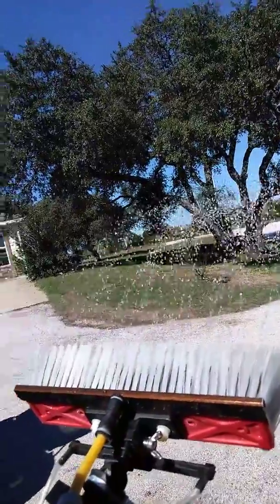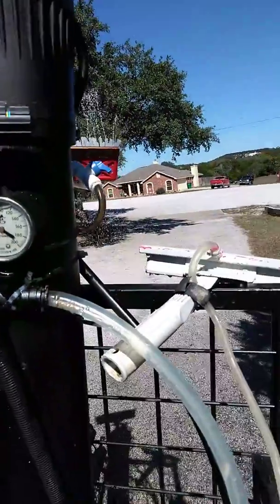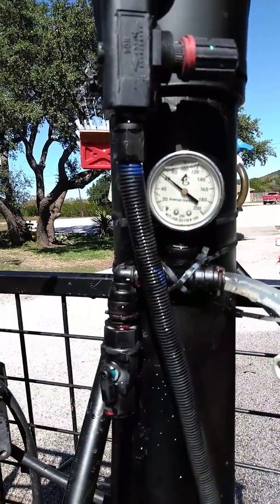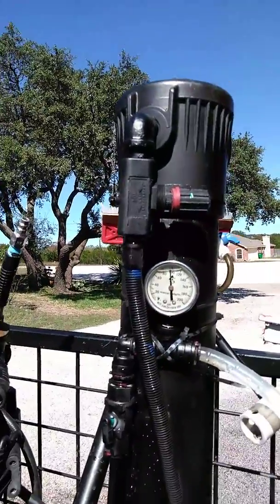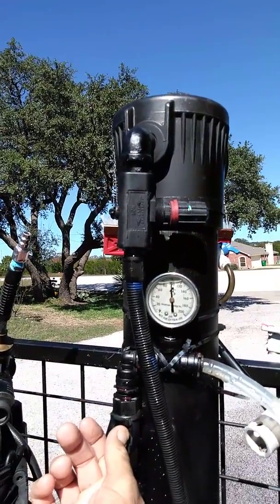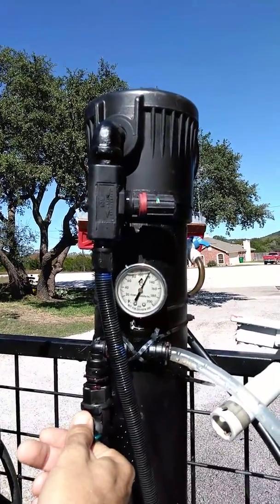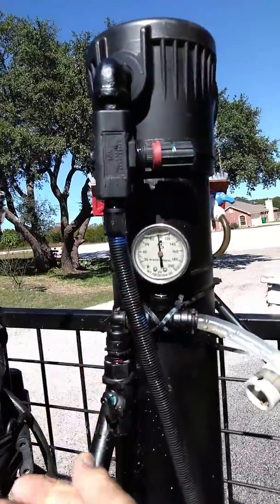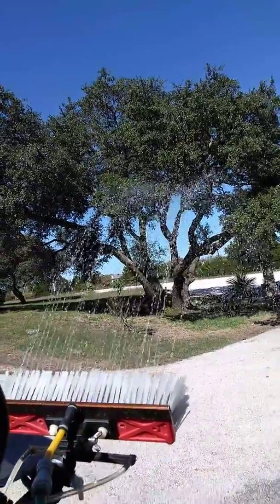One of the reasons I don't like ROs is unless it's boosted you get pretty crappy flow. That's not flow — I like my flow. So what I do is I've got to crank this puppy on and see if it cranks up. Sometimes you've got to do it a couple times — it likes its voltage. Now it's at 100. Now how much does it actually boost? It was 80, right? Now it's boosted — it's almost boosting 80 PSI. A lot better flow coming from there.